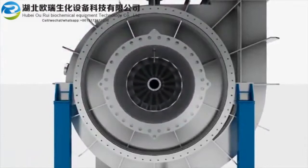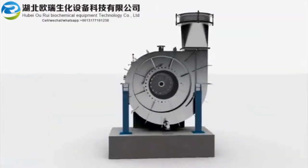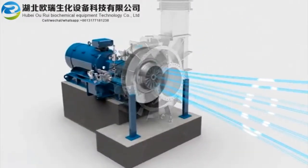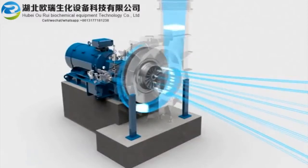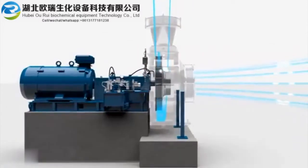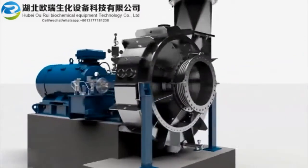The Exvel unit is an extremely robust, gas-tight turbofan, ideally suited to the pressures, temperatures and volumes of the MVC evaporation process. At its heart is an ultra-high speed impeller with a tip velocity of over 1,000 km per hour, faster than the speed of a jet airliner. The Exvel rotor probably has the highest tip velocity of any welded impeller ever manufactured.